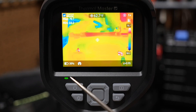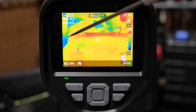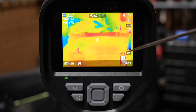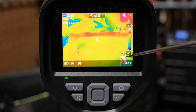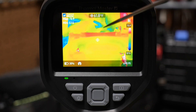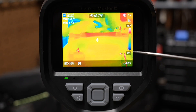This has a nice large high-resolution display. You can see the battery indicator for the camera itself. It's constantly scanning for the high and low temperature. The green pointer shows the lowest temperature spotted in the infrared camera's lens, and the red arrow shows the highest temperature. You can see the min/max at any time on screen. The temperature reading at the red pointer is shown on the right side, and the temperature in the center shows what the white crosshair point sees.